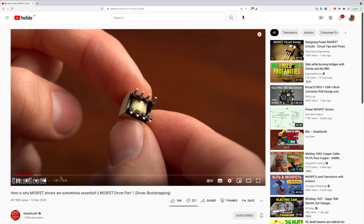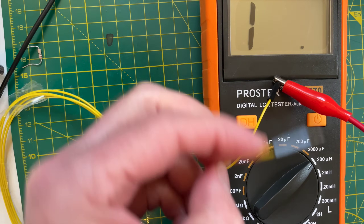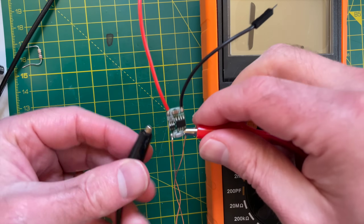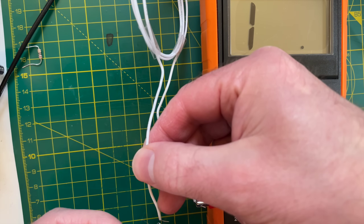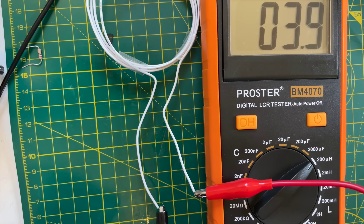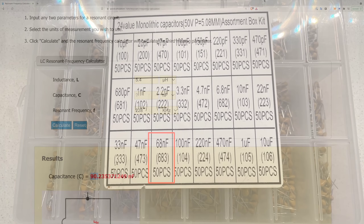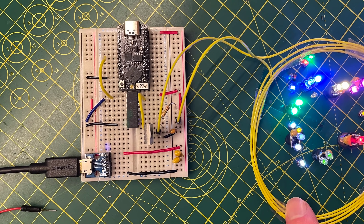Great Scott has done an excellent video on MOSFET drivers that's definitely worth a watch. For my coil I'm making one with the same number of turns and approximately the same size as the commercial coil. Measuring the inductance I get around 5.4 microhenries — the AliExpress coil comes in at 5.1 microhenries, so it's a good match. With homemade coils it's quite variable, anywhere between 4 and 6 microhenries. Plugging 5.4µH into the calculator with a 228kHz resonant frequency gives a 90nF capacitor, so 68nF or 100nF would be suitable. I ended up using 68nF after a bit of testing.